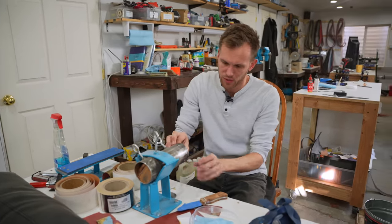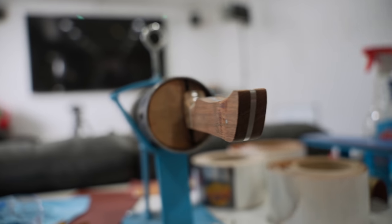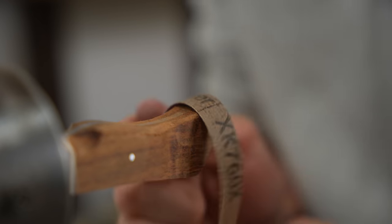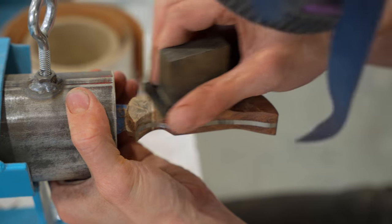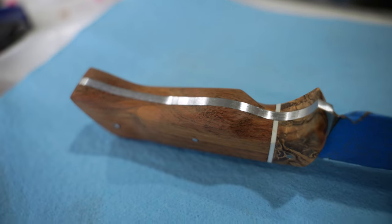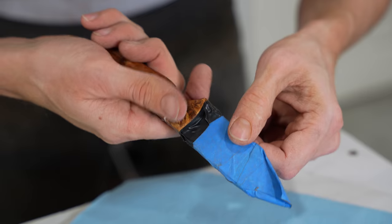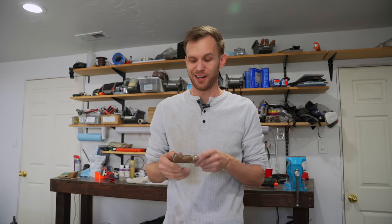I've done a lot of the machine shaping, and now I want to do a little bit more refinement on the handle, so I'm taking the whole knife over to this knife vise, which is designed to hold the knife by the blade and let me work on the handle from all sorts of different angles. I've got the whole handle sanded down to 800 grit, which is pretty smooth. Now I'm going to coat the whole thing in super glue — I have some very thin super glue, I pour it on, wipe it off with a cloth, and some of it gets absorbed down into the wood. I'll then sand it back up to 800 grit, and that leaves a very thin layer of super glue embedded in the wood, and then I can polish that on the buffing wheel.